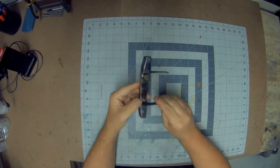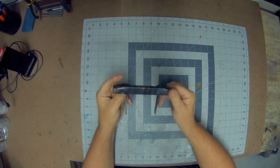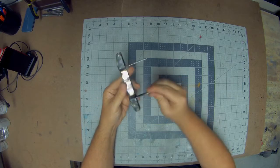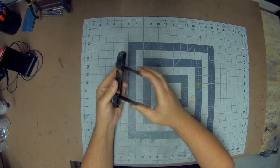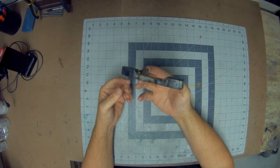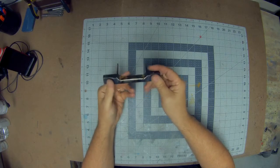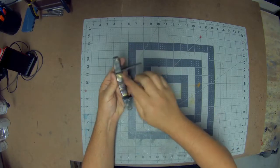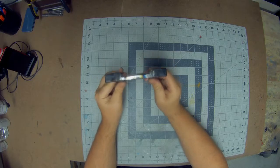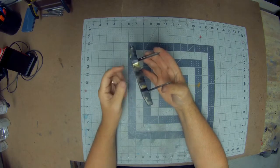Okay, so the bumper is now finished, minus throwing a coat of paint on and a little cleanup. We have these legs soldered on, which will fit on the outside of an SCX10 chassis, and quite honestly, most others. A fairly beefy, aggressive-looking bumper that still has enough cut out so it doesn't look like a big block of square tubing. And I think it should look pretty good.